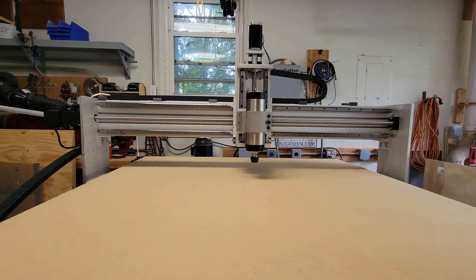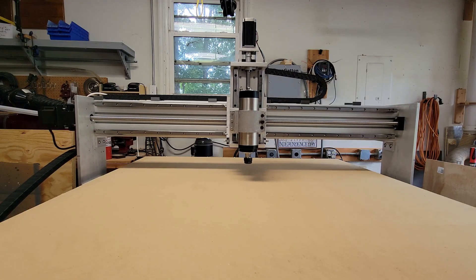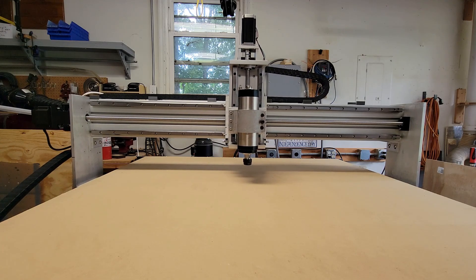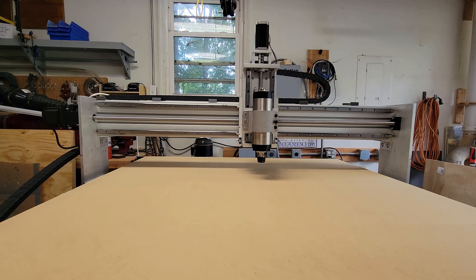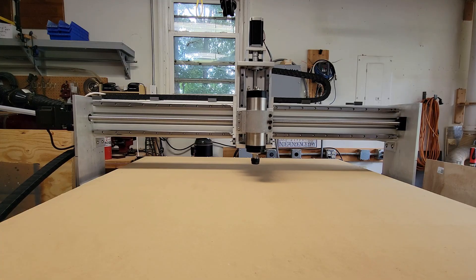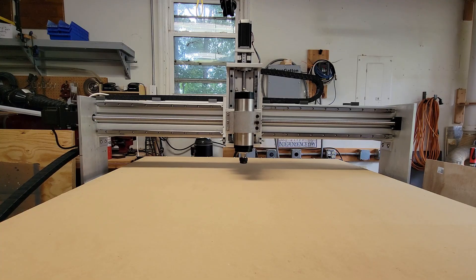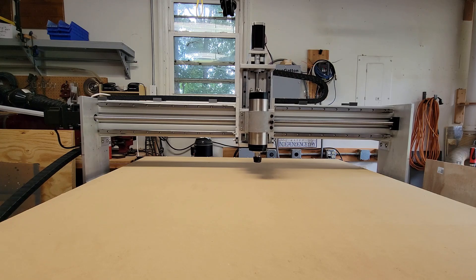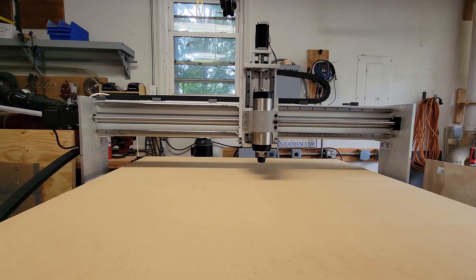The machine is alive and working exactly as it should. I have the spindle mounted but I have not run the cable through the drag chain as of yet. If you look on the wall behind the machine you can see the VFD mounted there. When I disassembled the Gatton CNC I just took the cable off, coiled it up, and hung it on the VFD, so connecting the spindle will be an easy task. I have a piece of 3/4 inch plywood on the machine bed and a piece of 3/4 inch MDF on top of that for my spoil board. I have not attached either of those yet as I'm still undecided as to what I want to use to hold material down. Usually I use several rows of T-Track with strips of MDF in between them, but I want to try something different on this machine — leave me a comment below if you have any suggestions for a spoil board and hold-down system.